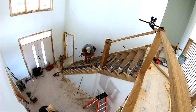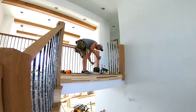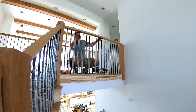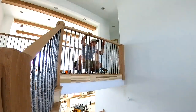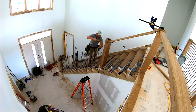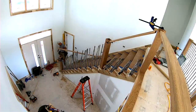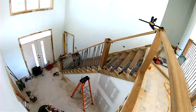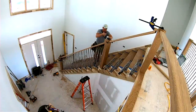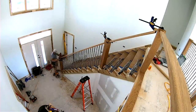It is finally time for the moment of truth — to find out if we've done everything correctly. If we have, the handrail will go in like butter; if we haven't, it'll turn into a living nightmare. The adhesive I'm using here is PL Premium. I'm putting the balusters into place and giving them some good taps with the hammer, and then it'll be time to drop the handrail on. The trick is to start at the bottom and keep a steeper angle on the handrail. As you go up, put the balusters into position and the angle of that handrail will continue to drop as you place one baluster after another. And that one went in really smooth.